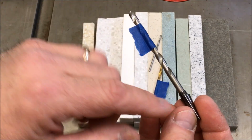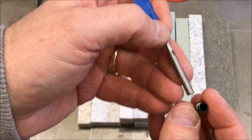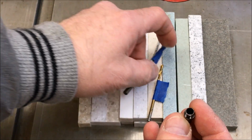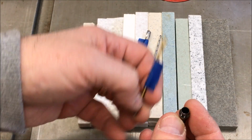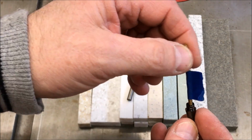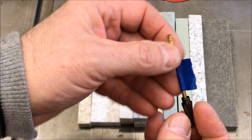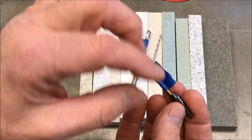And I got to thinking, this thing sort of tapers a little bit, number one. And number two, if I use this bit, look how thin I'm going to have to turn the Corian. So I decided to back off a little bit, and I went with a 1/8 inch bit. And the 1/8 inch bit leaves a lot of play so I can have a thicker collar down here on the nib, but it fits nicely down into the nib, so it'll taper nicely.